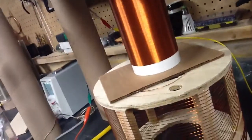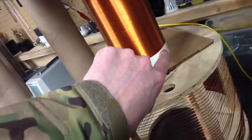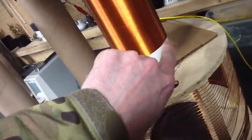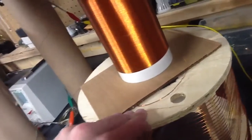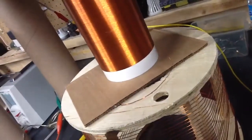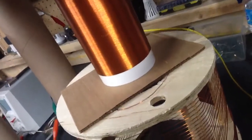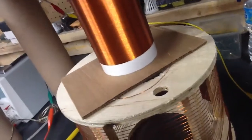Another thing I did was — I don't know if you can see it here, but the base wire there, I kind of unraveled it because it was going through a loop and a loop and a half or something. From doing really high voltage stuff, I've noticed that if you've got a kink in the wire in small turns, it'll kind of spark over and jump out.